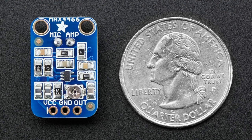The thing that really drives me the most crazy about ELECTRETs is they're kind of big, and you have to hand solder them. You can't put them through a wave soldering process — you have to selective solder or hand solder them. That adds expense to your manufacturing complexity because somebody has to sit there and solder them; you can't just pump them out from a pick-and-place machine.